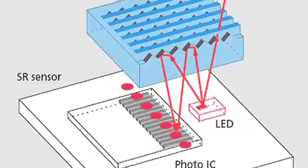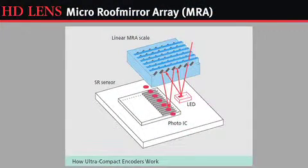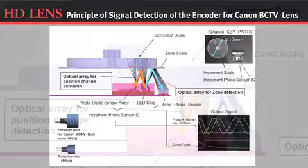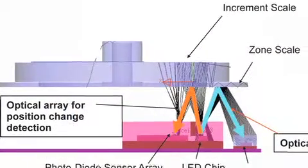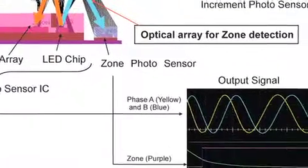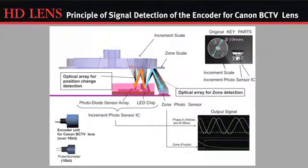Those indentations allow us to measure movement. The idea is that a light source — a precision miniature light source — shines a ray up onto that indent, and as soon as there's a movement it skips to the next indent. That ray is then sent down to a sensor which detects that movement with the precision of which I spoke.